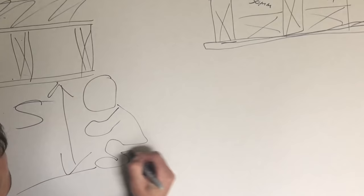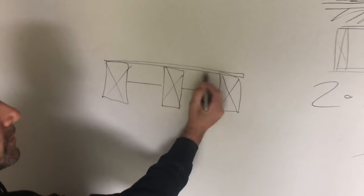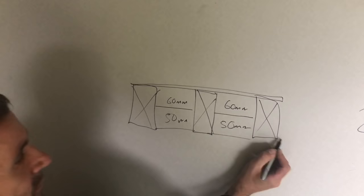So what we do, we have a sort of a hybrid roof. That's our roof joist. That's our OSB roofing on there. Right, on this one, what we've done, we've pushed our 50 mil insulation tight to the top. There is no air in there. Yeah, and then on this one, it's actually, sorry, 60 mil we've used on this one. Thanks, Adam. And then, because you want sound block, we've then put our 50 mil sound block in there. We've then put our moisture barrier on, which Amy is stapling and Sean will show you now.